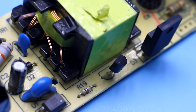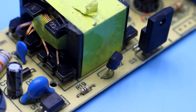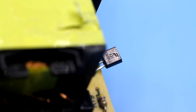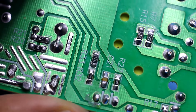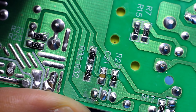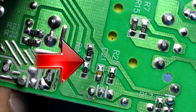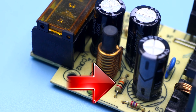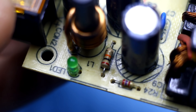After installing the transformer, we must find the TL431 chip. As previously said, it sets up the output voltage. In its binding we find a voltage divider. In my case, one of the resistors of the divider consists of a pair of SMD resistors connected in series. The second resistor of the divider is installed closer to the output — in my case it's 20 kOhm.